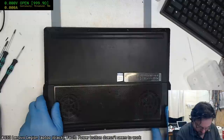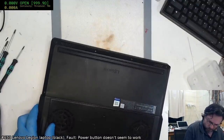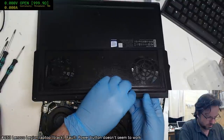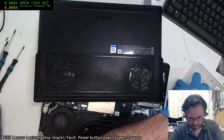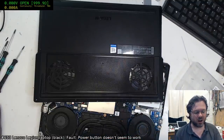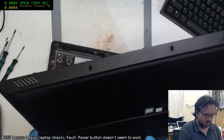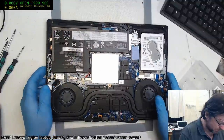Export your schematic with text searchable part names and network names. The only recommendation I would make is that your part and network names, your part names in particular, be something a little more lengthy than just like C9 or something like that. Mostly because otherwise you'll get a whole lot of search hits for C9 just in general throughout the text in your schematic.